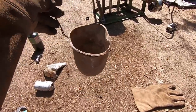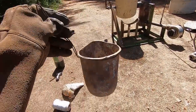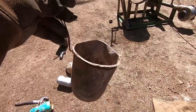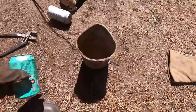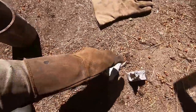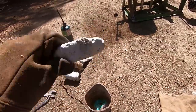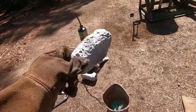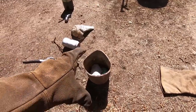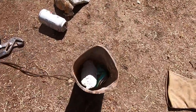All right, guys, it's a little bit janky, but this is actually my crucible for today. It's just a steel hubcap, so it can withstand a lot higher temperatures than what the aluminum can, so it should work pretty well. Also, that was a great pun. I'd just like to point that out. So what we're going to do is crush up some aluminum cans and throw them in there, and I've actually got some aluminum from a previous melt that I just did with some firewood and a hole in the ground and a hairdryer. So this is just melted down cans as well. We're going to throw that in and see if we can get this up to a decent enough temperature to actually liquefy. I have no doubts that we will, guys.